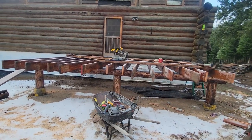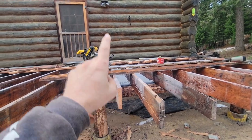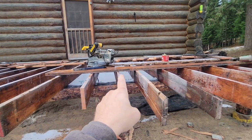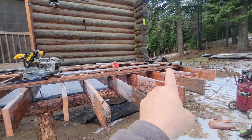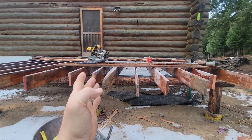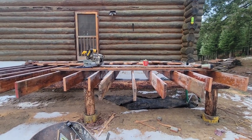So I started in the middle. My middle is perfectly square — I measured and did the Pythagorean theorem, squared it off, and made sure it was perpendicular with the house. I'm going to start adding blocks to the outside and measure to make sure I'm 16 on center all the way to the edge. At the very last block I can make a small adjustment. I didn't want to cut the end block three inches short — then all my boards would have been crooked. I guess I'm a little anal about doing things right the first time. My blocks weren't super tight before, so I'm going to make sure those suckers are tight. Let's put the blocks in — as soon as the blocking is done, I'm decking this bad boy.